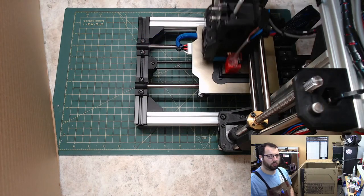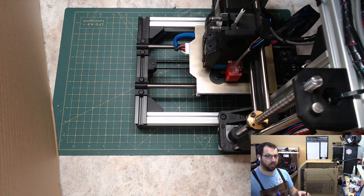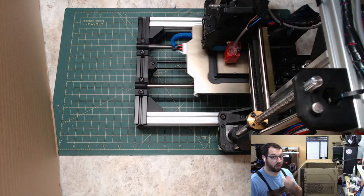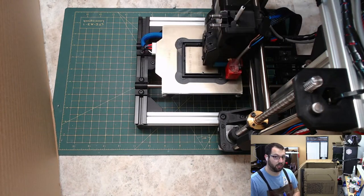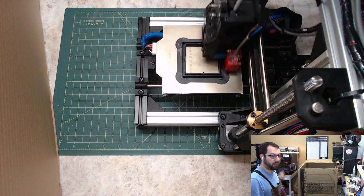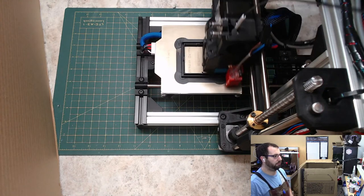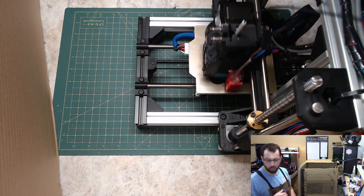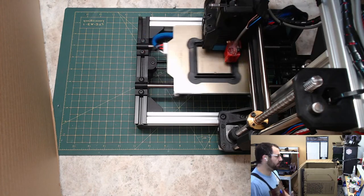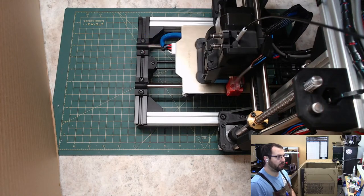Plus also, you don't want your parts to be super stiff. The gantry does need a little bit of flex to it when it does the quad gantry leveling. And also, if you have a nozzle crash and all your parts are super stiff, your part might break something. Versus before, I've done nozzle crashes in my ABS parts, and I watched the whole carriage go, and you're like, oh shit, and no damage. Because ABS, when it flexes, can return to its original shape relatively easily. It's nice to have a little bit of spring, but you don't want it falling apart.